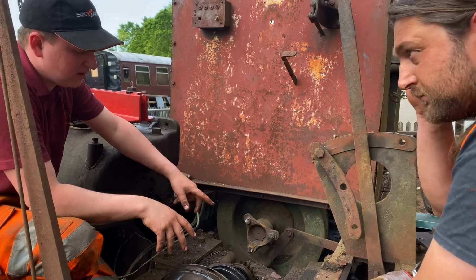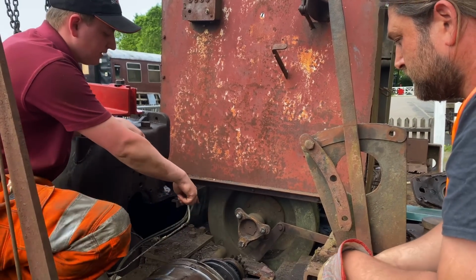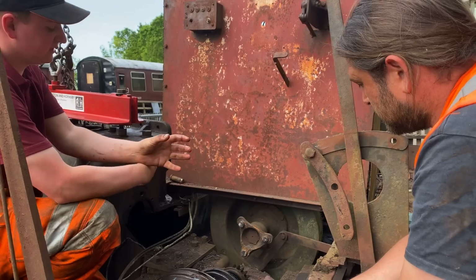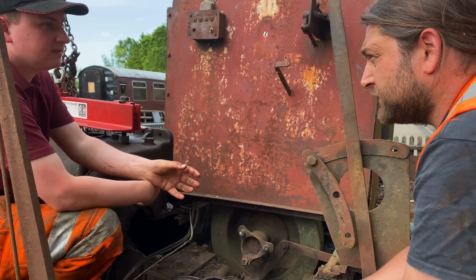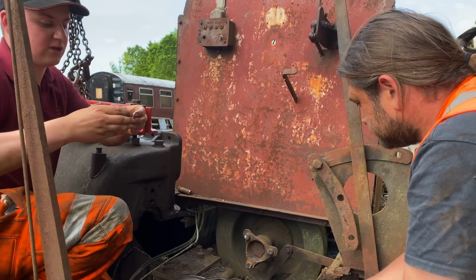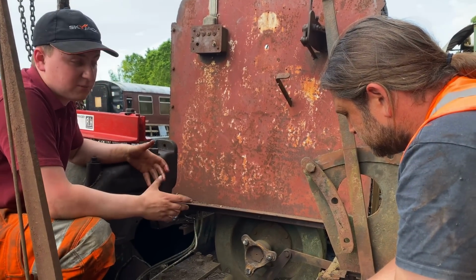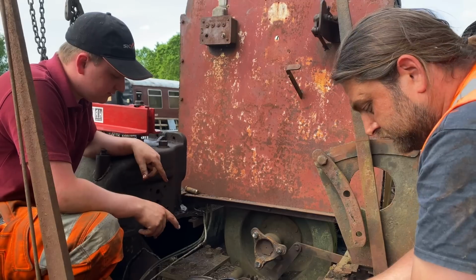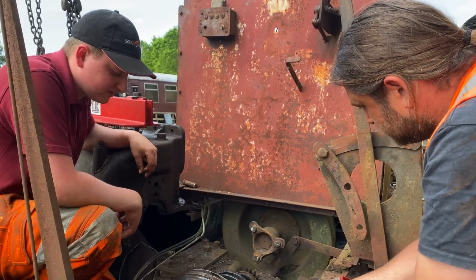If you leave the tap open when you start it, all the oil runs to the front gearbox and basically sort of hydrolocks it, so you can't select a direction. It's a dog clutch, a dog gear. Sometimes you have to bounce it on the clutches, or turn it to get it in, because it's literally two teeth, and they either go in or they don't. But with oil in there, obviously you can't compress a liquid, so it just doesn't move. So it's just a bit of an old-fashioned design.